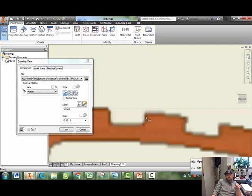For a scale model, the material here is going to be thinner. It's going to be close to a 1/16 of an inch. So I'm going to put in a scale that scales this down so that the smaller, thinner wood is going to fit where the thicker one should be. And the way I'm going to do that is I'm going to take the measurement of the wood that I'm going to use for the scale model. So if you look down at the webcam, I'm going to measure this, and I'm going to put that measurement.